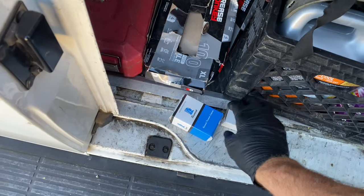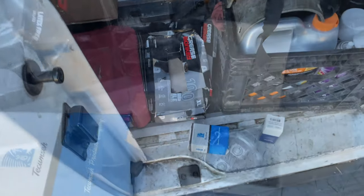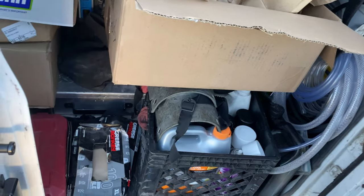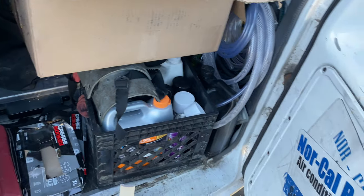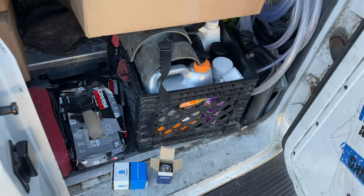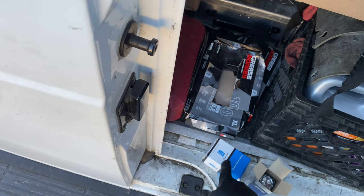I've been burning through these things, changing out the crappy ones and putting these in. I love it with the defrost feature. All right, here we go — OEM relay, start cap, and hopefully they put the resistor in there for me because I know they charged me for one. If you're new to the trade, the resistor keeps this thing from hanging up. Yeah, there it is — the resistor. It's important that you get the resistor; it doesn't come from the factory with the start cap, it was separate. The resistor is going to help keep the contacts from sticking.